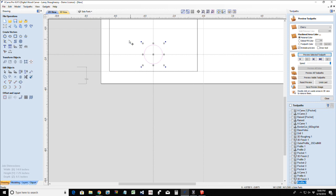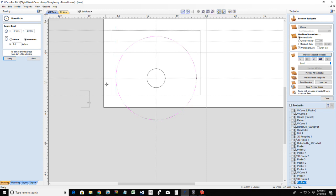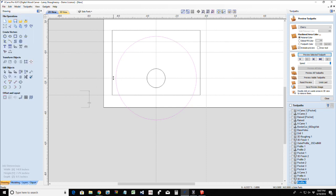Now, if this was a 5.5 inch roll, 5.5 diameter, right? I want that clearance in the back. The front's no big deal, but the clearance in the back, I do not want to be rubbing that back, and I only have a very small amount. So since I don't mind if I go forward a little bit, I may bump this forward ever so slightly off center, and ultimately take that away from that backer a little bit.